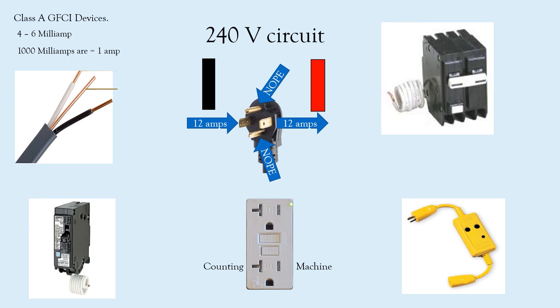I hope this video added a little bit of value to you. You do not need the equipment grounding conductor at all for a GFCI to function properly — on a 120-volt setup, a 240-volt setup, or a three-phase setup. It does not matter; it's not needed. That is one of the paths that current could be leaking on in a true ground fault, but it's not needed for the device to function properly. I am the Electrical Code Coach, and my goal is that this video adds value to you, and you in turn add value to others.